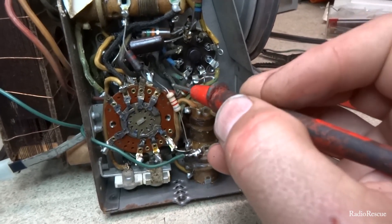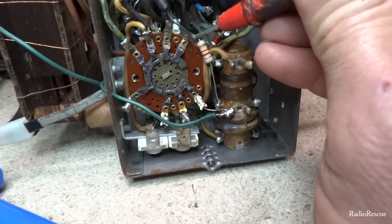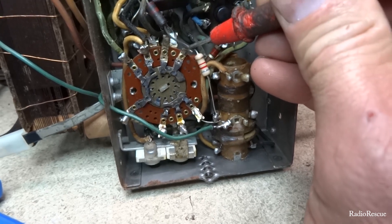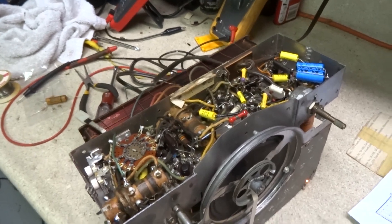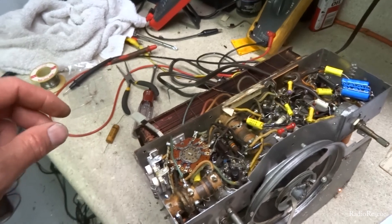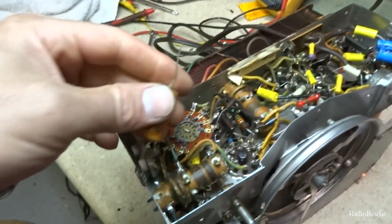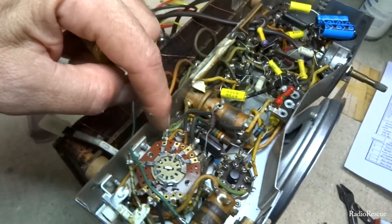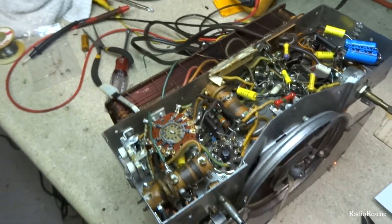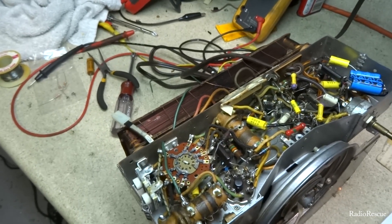The new resistor is tacked in and it still doesn't like being touched with a probe lead — but when I touch it, the radio comes back in, and when I remove the lead, it's gone. We got that sorted. Now I found a leaky capacitor — that yellow one goes up underneath the band switch, back to the tube, and to the tuning capacitor. I replaced it. The voltage on that circuit was quite a bit higher than the schematic spec.